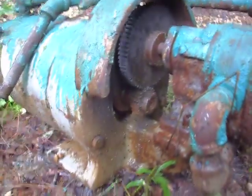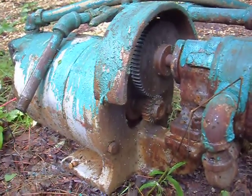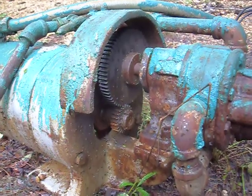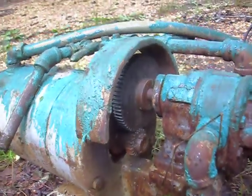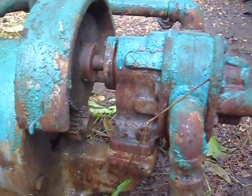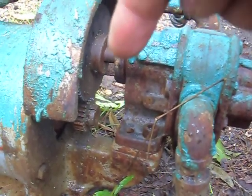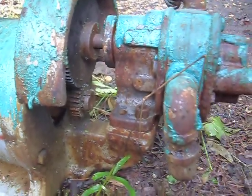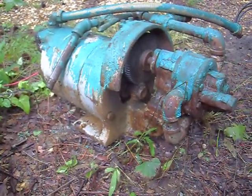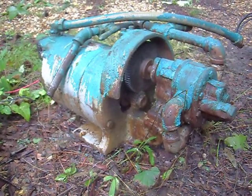And you can see the speed reduction. There's a small gear on the end of the motor shaft. It's actually got a bearing retaining nut. It's probably fine thread. Special motor. It's got a guard out of cast iron. It's actually got these old pumps, man. You can kind of see it's the packing. It's actually got a rope seal and packing in there. But I don't see much use for this pump. A submersible little giant pump would probably be the way to go.